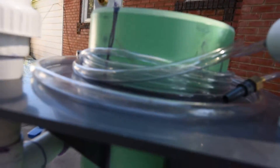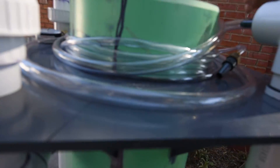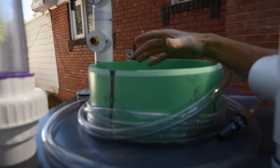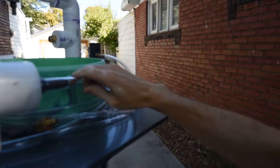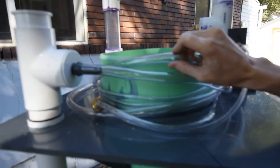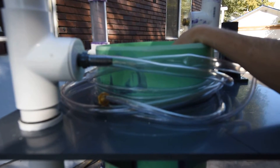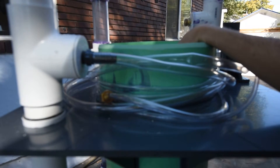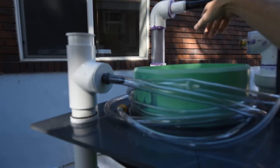That's the one drawback with building something like this compared to a commercial skimmer — clear acrylic is way expensive. Not that this is cheap, but I found this in a scrap pile. The one part I'm still waiting for is a 4-by-12-inch reducing bushing that will serve as my foam cap. The reason for this tube is the owners were a bit concerned about evaporative cooling. My thinking is conservation of energy — the energy has to go somewhere; it's going into the air when things evaporate as the bubbles pop. So air is siphoned back off of the skimmate collection container and run back to the Venturi valve to reduce that.